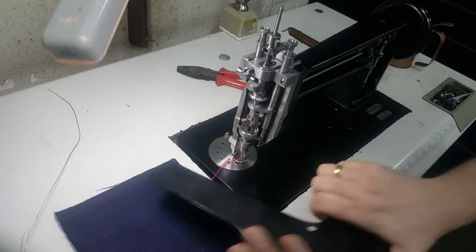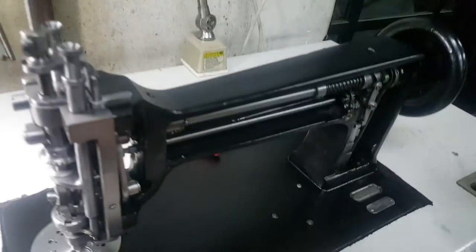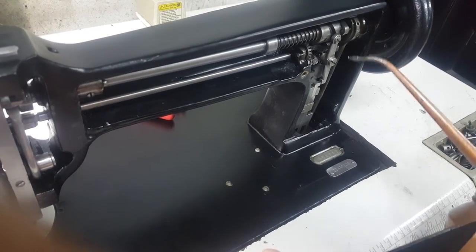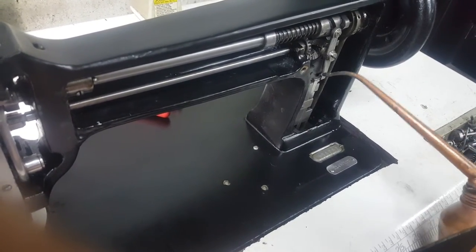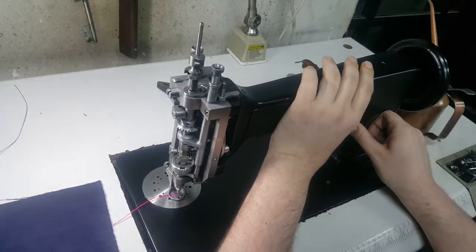Replace your cover. Make sure this is oiled well, especially if the machine has been in transit. We need to oil that hole there, we need to oil this hole, the gully, plus this one here — the main rod that runs through. Otherwise it can get stuck.